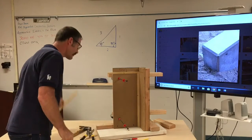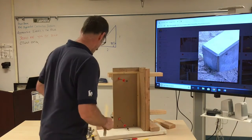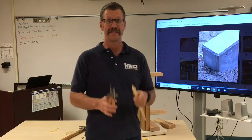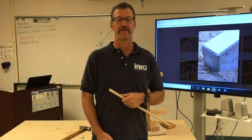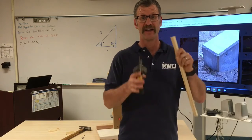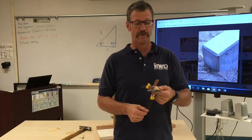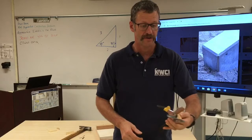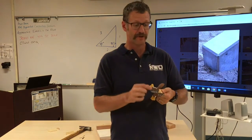Now, piece number 3 would be this side that's going to go against our bulkhead. That third piece, you need the double bevel. It's a double-sided 45. Sounds complicated, but it's actually quite easy. Here's all you do. You start off with a 45, and it doesn't matter which side I cut that 45 on. What does matter is always how I place my piece of chamfer in my cutters.